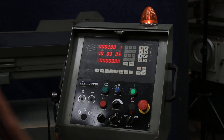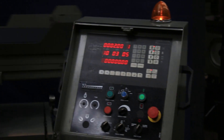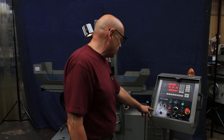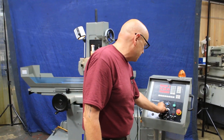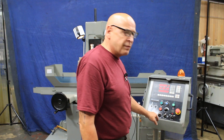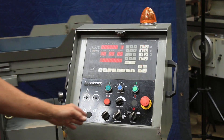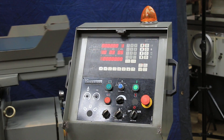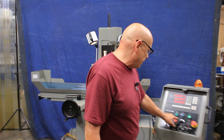There's the power on, your emergency stop, your cycle start. They're not using the chuck because this has a permanent magnet chuck in here — a very fine pole, nice chuck, brand new chuck it looks like. Cross-feed amount is selected here with this potentiometer. Whether you want to plunge feed, you also have surface grinding and plunge with this. And this is your mode selector switch.